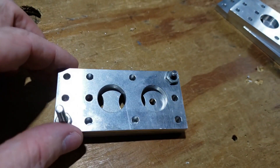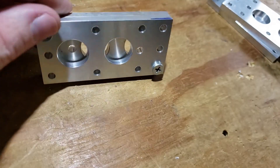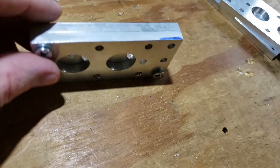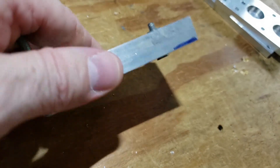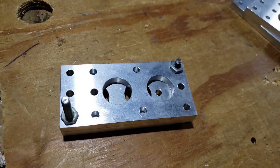To get the additional holes I need, I bolted them crisscross and I'm going to drill holes right here and right here by transferring these holes over. The same over here - I'm gonna crisscross, and then I'll have the two pieces I need to have the middle drive shaft.